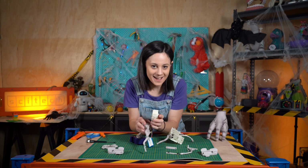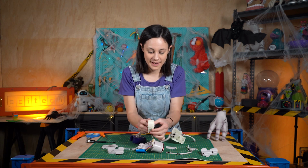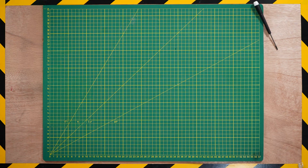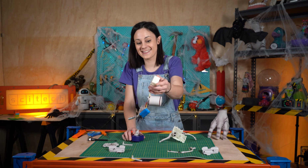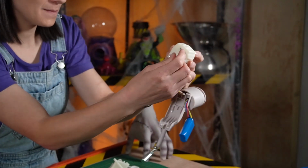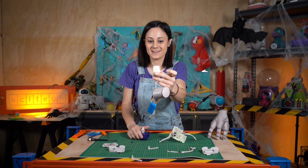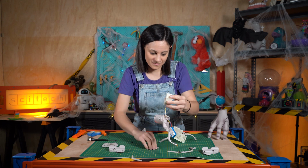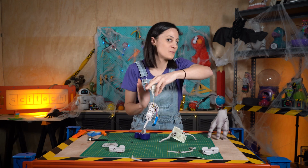Okay, so I think we've worked out how our different fingers or legs move at different times. So here's our motor, and it's attached to these cams on each side. Basically what a cam does is, when attached to something else, it turns a rotation into a linear movement. So we can actually see that there's cams on the side of this motor here, and the attachment for those cams are at different parts of the rotation. So essentially what you get is kind of like pedals on a bike or like a train movement. When attaching a linkage to the cam, that essentially just turns that rotational movement into a linear movement,